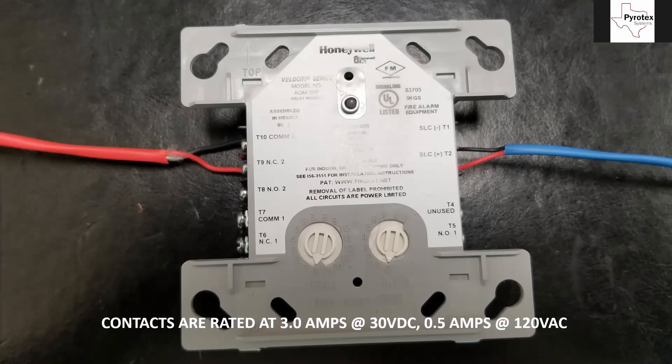At the bottom, I left the ratings on there. That 30-volt DC rating is basically the same rating we're going to use for 24 volts, 27 volts, or whatever our panel is putting out. But the one we're more concerned with for smoke dampers is that second rating — half an amp at 120-volt AC, like we saw in the last slide. If you've only got one or two dampers on your circuit, doing it this way is really simple, quick, and it's going to get the job done just fine.